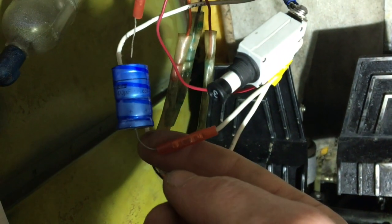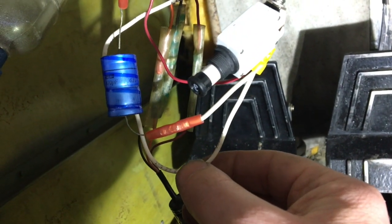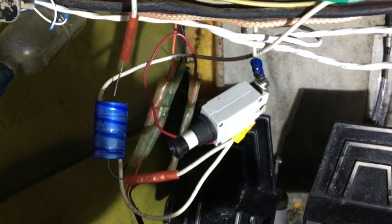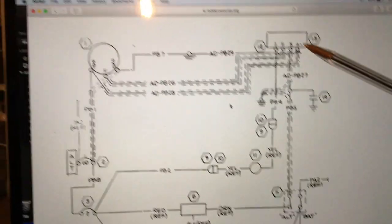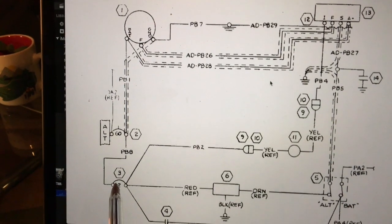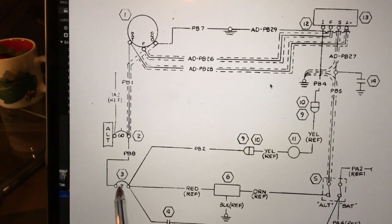Could it be this capacitor leaking, connected to the wrong place? I think I have to take these off one at a time. This one goes up to the high-volt warning light and it could be coming back through there — which might indicate a regulator fault. I found the source of my feedback. We proved that this was the device which had failed or gone high resistance. That's our bus bar and we've now got a 2-amp breaker installed in there.